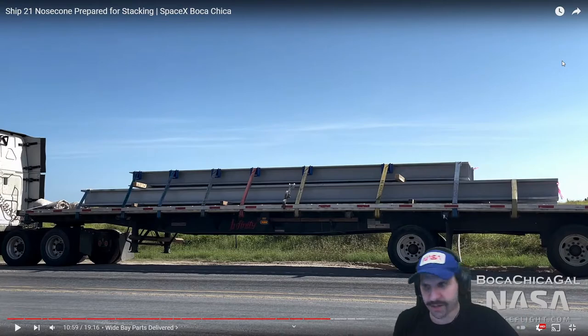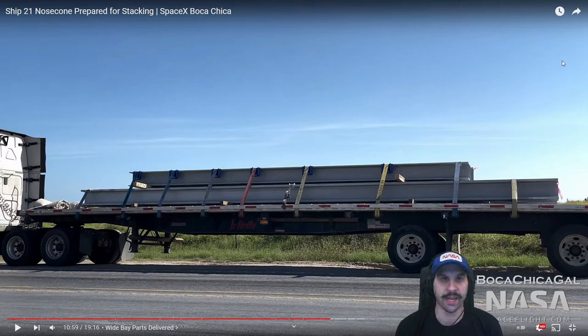I wish we could make expander cycles bigger. You can make expander cycles bigger, T-Man, but there's always a theoretical limit. It depends on your propellants and the surface area that your cold propellants are getting exposed to when your engine starts up. With an expander cycle, you're limited by surface area because so much liquid hydrogen can only cool so much engine. But yeah, it's a little more complicated than that, but that's the gist of it.